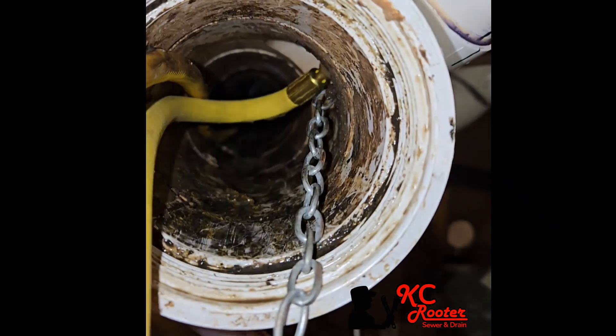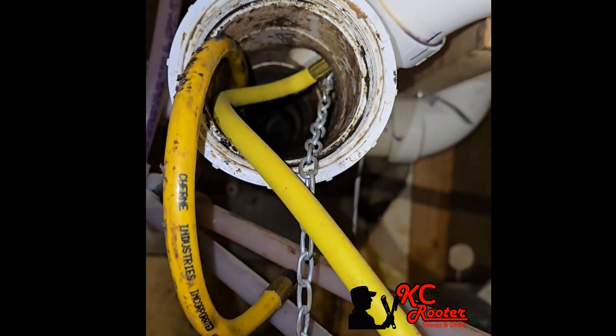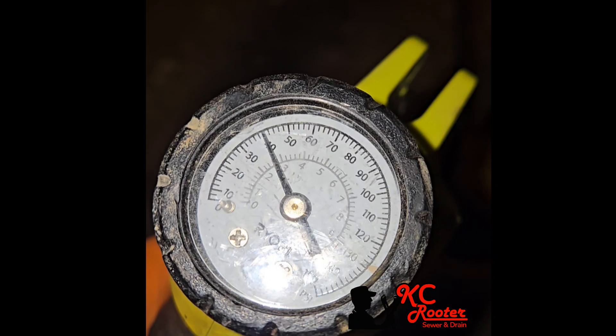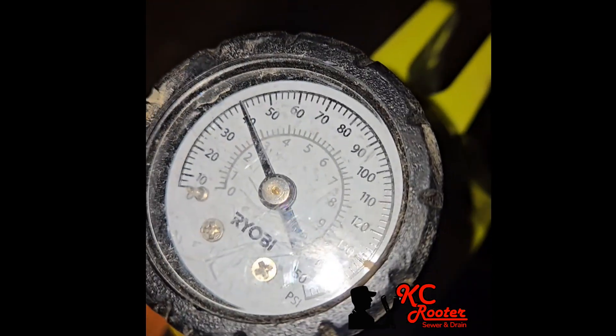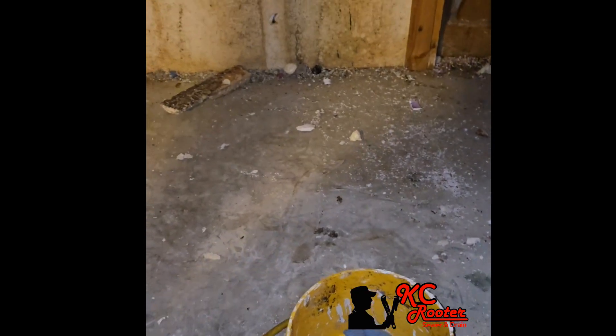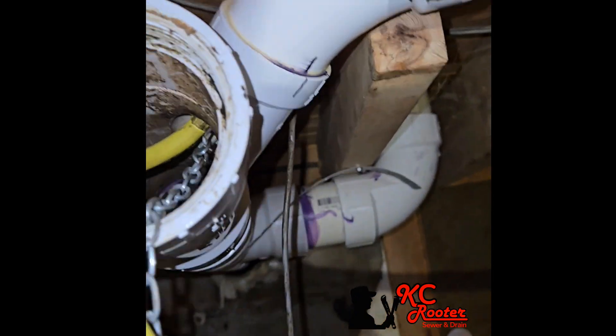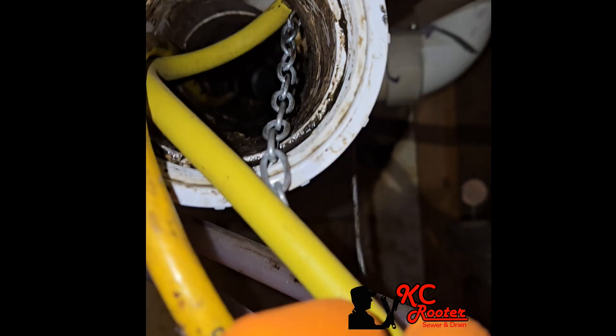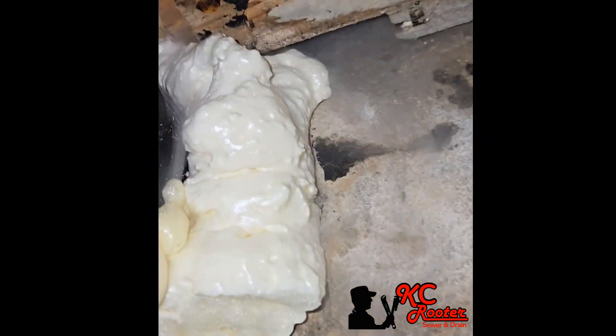We're putting some test balls in the pipe to isolate the most likely area where it's coming from. They were smelling in this portion of the house the most. They just had a sewer pipe put underneath a nice patio right outside. In my sewer camera, it looked kind of sketchy, and it made the most sense that it was coming out of the sewer pipe underground and coming through the cracks in the foundation underground.